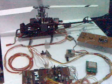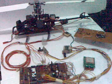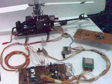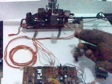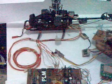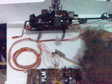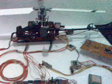And then from there we ask ourselves, okay, after pushing up and pushing down, how do we detect objects? Because once it's moving, by controlling the pitch, it needs to know whether it's heading towards a mountain or not, right? So how do we do that? By using the front IR to check for objects in front, and the bottom one to check for objects underneath, so that if it's going up a mountain, it will know, okay, I'm a bit too close to a mountain, so what should I do? Should I increase power to attain lift or not? All that stuff it will do, and it will demonstrate it for you.